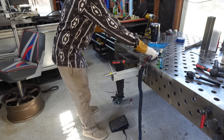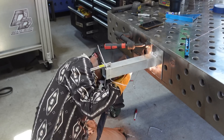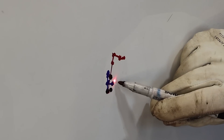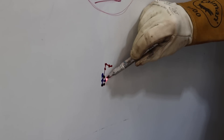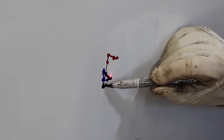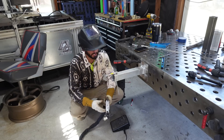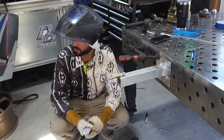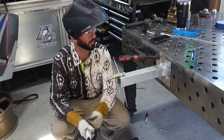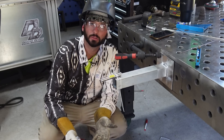Let's slap these other two welds on. It's still pulling — I'm watching this thing move right now. We went down, which makes sense because that was the direction of welding. The biggest takeaway from aluminum is you can't just assume where it's going to go, because it takes time to actually cool off all the way. The thermal expansion on aluminum is just way different than stainless or carbon steel — it moves a lot, just way slower.